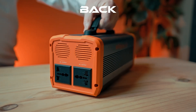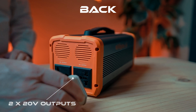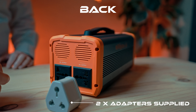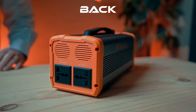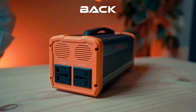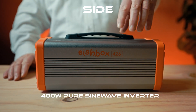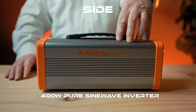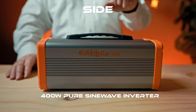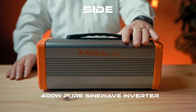On the other end of the box you have your AC outputs — 220 volt outputs. If you look at them, you'll see they do not match any plug you have in your house. Hence we provide this adapter with the unit, which has a normal three-pin plug on it, so you can plug an extension cord or multi-plug directly in. Between the orange bits you have a 400 watt pure sine wave inverter internally. That's quite important, especially for newer TVs and CPAP machines. Modified sine wave inverters give a square wave that can upset those electronics, so this pure sine wave inverter is substantially better.